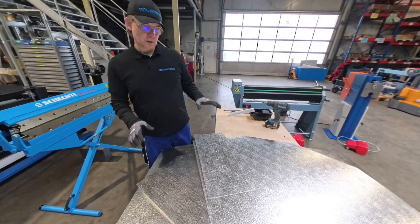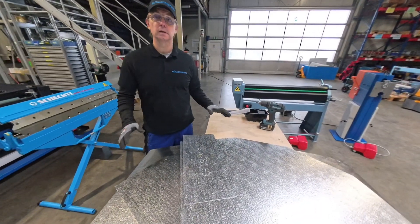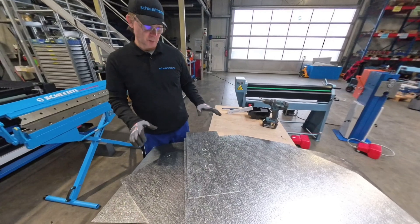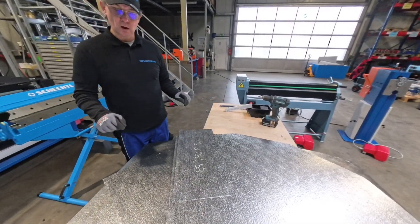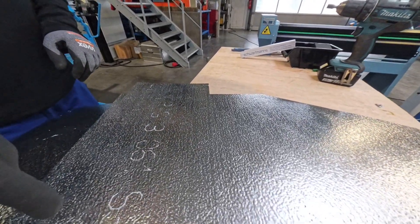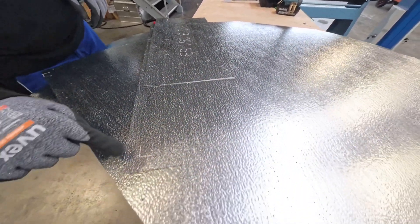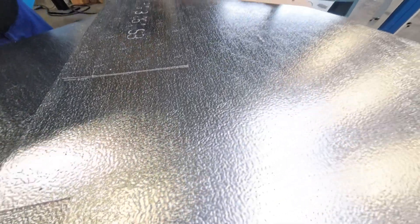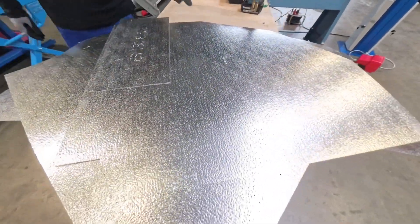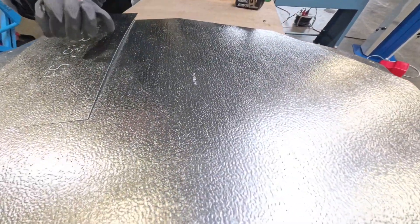Now we have cut out the duct piece and the band. I'm not going to cut the whole duct from the isometric — only one part. The engraving on the metal shows the position number in big numbers. It's aluminum stucco — it might be hard to see on camera but it is there. We also have the cut lines and folding marks where I have to fold, so everything is marked with laser. It's also possible to change the height of the font in the program.